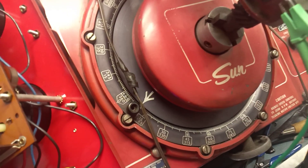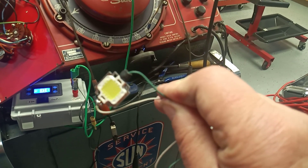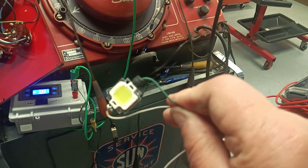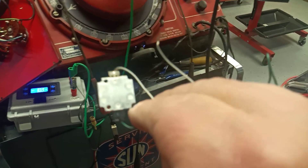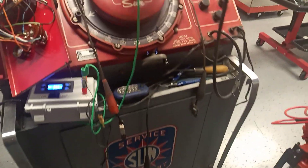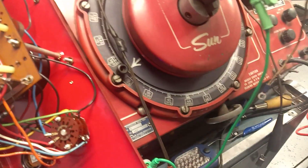With the dwell flash, we'll be able to read the dwell directly. In place of the standard neon tube, we're putting in this 10-watt LED. This gets bolted right onto the lens so there won't be side flashing — all the light will come out right where the arrow is, through the lens.